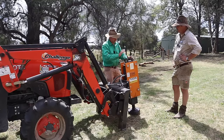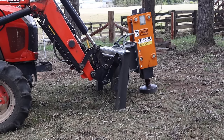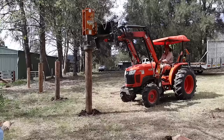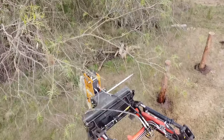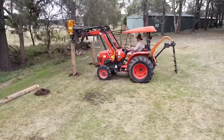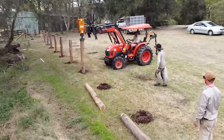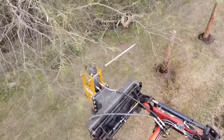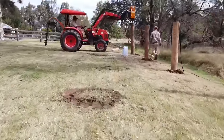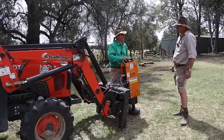Talk us through the process of driving a post with this. You don't have as much hydraulic adjustment as you do with a standard post driver — you don't have that mast that you're able to throw around. So how do you overcome that on the front mount of the tractor? Jared reckons the front mount is actually an advantage: for the sort of work they do they're rarely in a nice open field — often in small tight spaces under tree branches. The benefit is you don't have to allow three metres of space above for a mast plus hammer. You can nose in through trees without damaging anything around. It'd be perfect along creek lines too, as long as you've got stable ground. With all that weight up front it does get a bit tippy, but you get used to it — put your seat belt on and enjoy the ride.